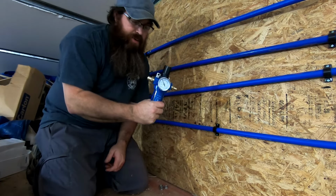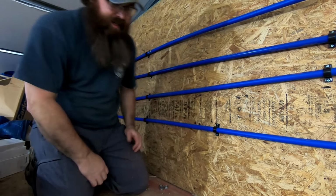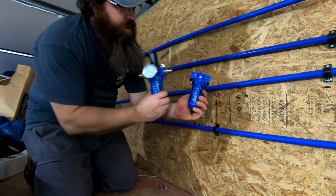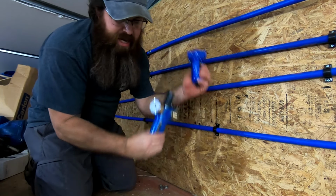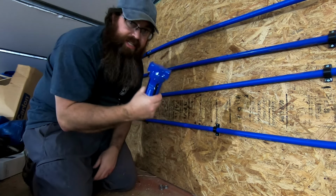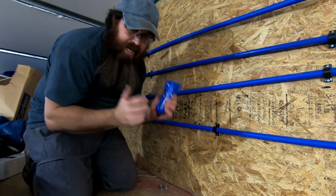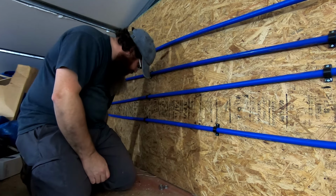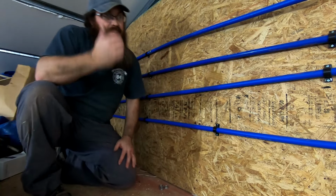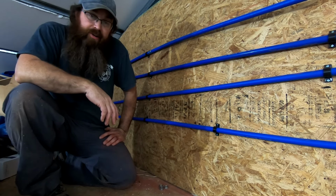We've got this Nampu piece here that's gonna go in. That's gonna be our regulator to set our 105 PSI coming out into the shop. And then we've got one of these to go with this. It's going to go at each one of our drops. We're going to put in 3 drops. We'll have 3 of these set up in the shop. They drain just the same. Metal housing again. You know, that was the selling feature for me, was the fact that they were metal. Seen a lot of people complain about the plastic ones. They break or whatever the case may be. But this is our system. We are set up, and we're ready to continue plumbing and turn the compressor on.